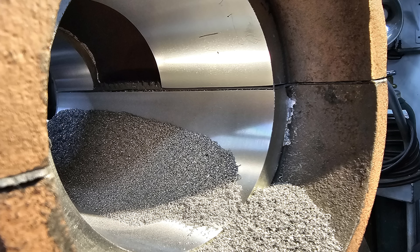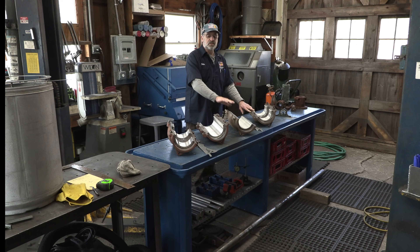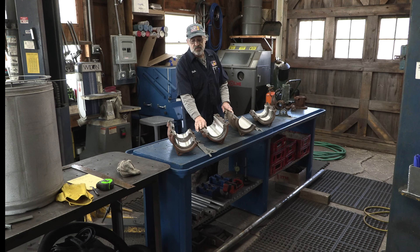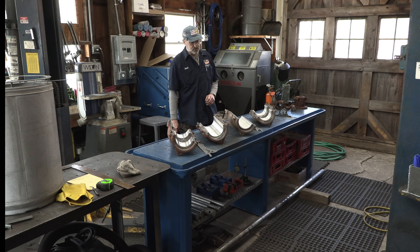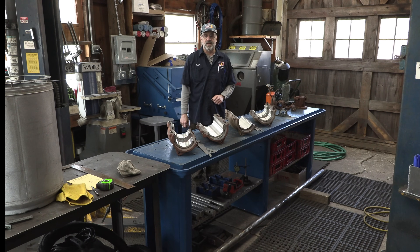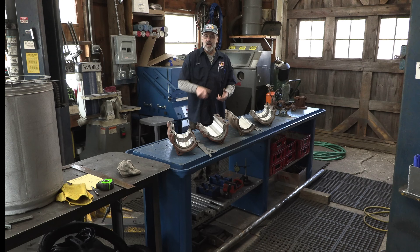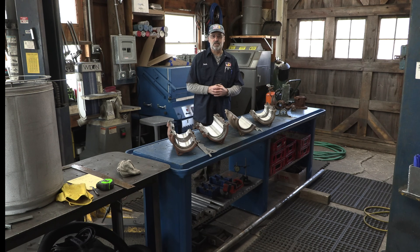It's incredibly night and day. You can do a lot with a torch and I have in the past, but this is a large project and a large pour. That pot that I have is every bit needed to pour that first bearing, because of how much material was needed to really get this one to pour. Once I got that one there, I knew the project was going to continue on a good path — and it has, it's been great. Using our lathe for a horizontal boring machine is second to none, actually. To be able to machine with your lathe without using your compound, cross slide, or tracer attachment — it's just as simple as can be. Thanks for joining me here at Job Shop USA.